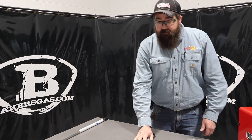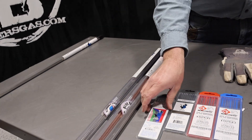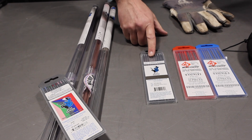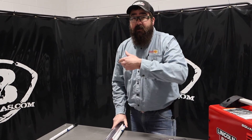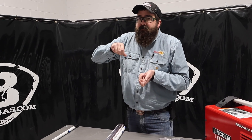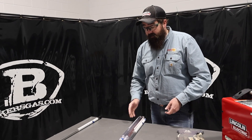If you're just brand new to TIG welding, having those three packages — 308, ER70S6, and 4043 — is going to cover probably 90–95% of what you're going to get yourself into just trying to learn how to TIG weld. And with the multi-mix tungsten pack, I'd get that just so you can try them all out. It's a very versatile tungsten and it holds up good. Another thing is sharpening your tungsten — we'll link that down below as well. We have several tungsten sharpeners and did a couple of videos on those too. I've seen a lot of people using hand grinders and turning them different ways — that's tough. For the extra $400, you just got a smoking deal on your TIG machine, so just buy a tungsten grinder. Use it. It works great and it's a whole lot safer than trying to do it on a hand grinder.